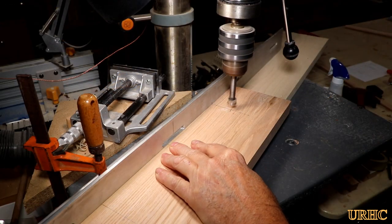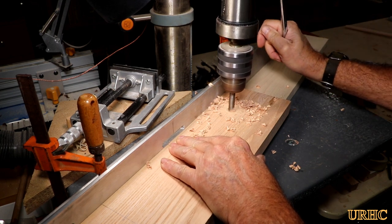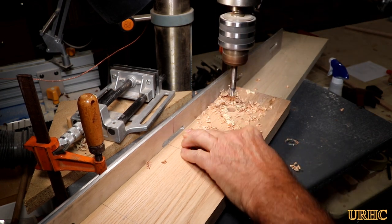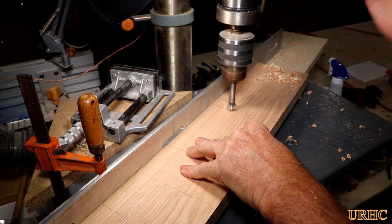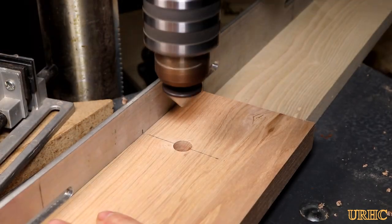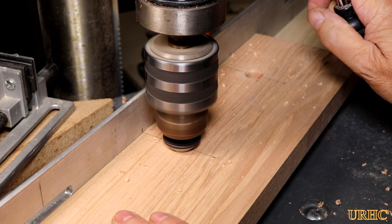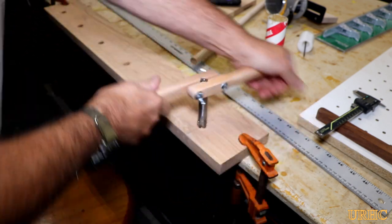Then it was just a matter of doing a little bit of layout for the centers of all my peg holes. I decided to use the threaded look on these again, like I did on the headboard, so I drilled clearance holes for the three-quarter inch tap for the Beale kit using a forstner bit. I used that aluminum straight edge — it really makes it easy to work with longer pieces. Then I used the Beale countersink bit to break the edges on the holes that are going to be tapped, which keeps the tap from ripping out the grain alongside it.